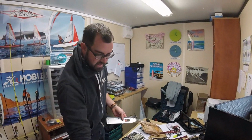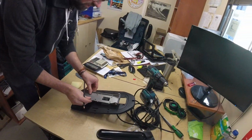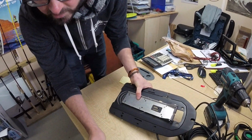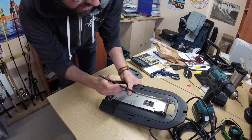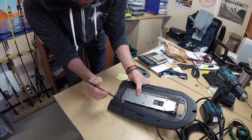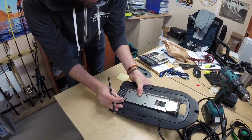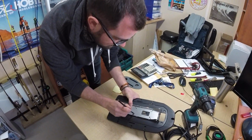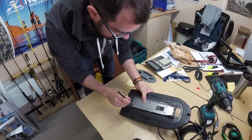Okay, so now we've taken the transducer and bump plate out of the way. That leaves us then to use the metal plate, which we're going to line up, and because we've taken the transfer lines on the side of the transducer and then marked them straight across here, we know that left to right we can go like that. Same with the back, line up all of the horizontal lines across, make sure they're pretty much neat and perfect, get the plate neat and perfect, and then you're going to use the inside holes which are on the plate, and that's all 4 of those.